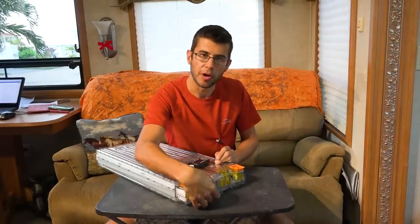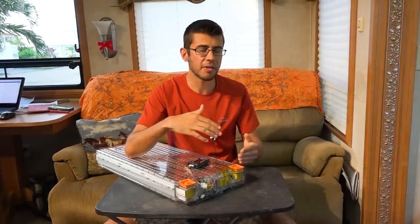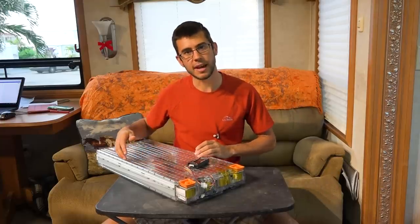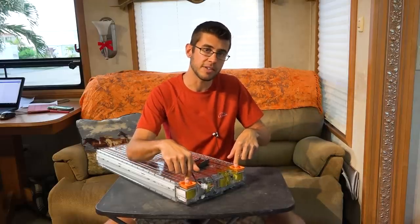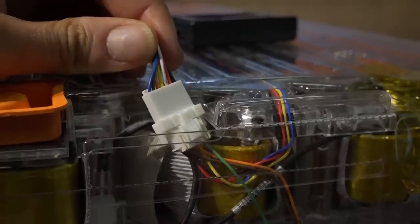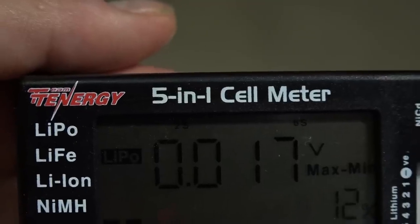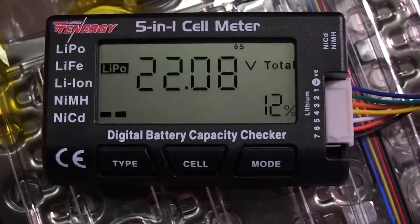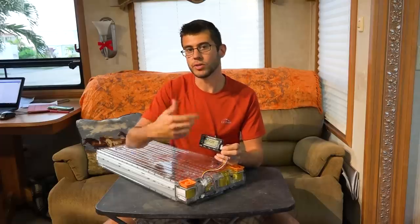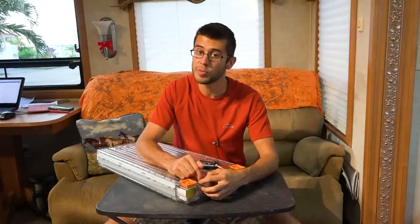When they come out of the car they have an electronic board on this end — that's the BMS battery balancing board. I had that removed because I wasn't going to be able to use it, but what that board did was monitor the cells inside to make sure they were within voltage specifications, and also monitored temperature at the outputs to make sure it was operating within proper temperature limits. The leads that are part of the battery are still intact, and I connected a simple battery monitoring system: a Tenergy 5-in-1 cell meter that can read the overall voltage and the voltage of each individual cell and tell me if anything is out of spec. I have it set to alarm if any of those voltages go out of range.